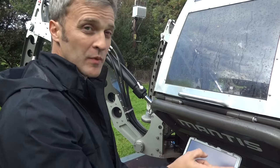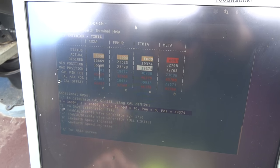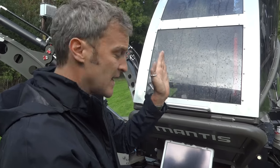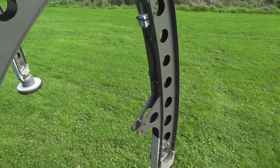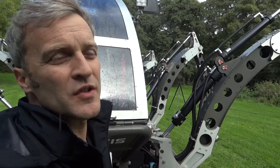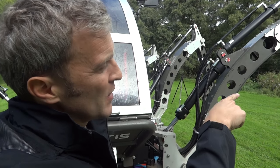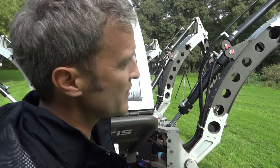I've just gone into another screen within the utility, which is a really low-level way of controlling things. Effectively here I can switch on a sawtooth wave generator to drive the leg back and forwards, either between quite a small range or the full range of the ram theoretically. This is quite useful for tuning the PID loops — when I get the PID controller plugged in on the legs I haven't tuned yet, I'll get it running in a loop like this and I should be able to see a graph of the following error.